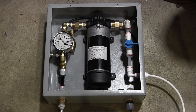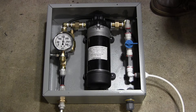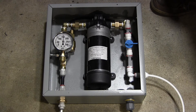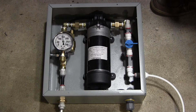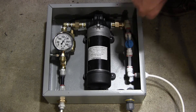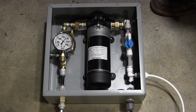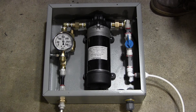Starting it back up — you heard a little clicking going on. Looks like we've got a little air. I had this supply valve off — there we go. That clicking was the actual solenoid turning on. If I pull the power back off, you can see the solenoid bleed down, and there's where the solenoid actually shuts back off.